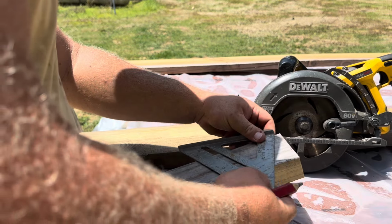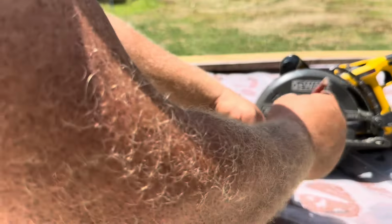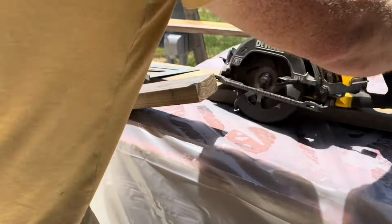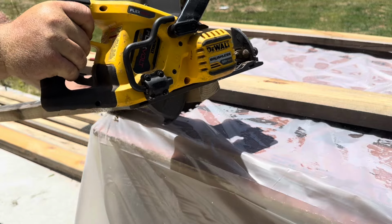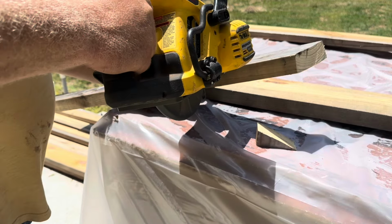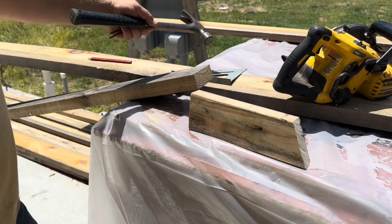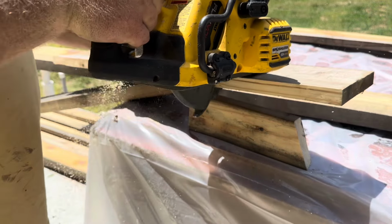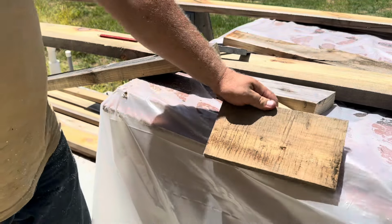We're going to take, set our pivot point up here, come down here on our common cut, and we'll come to a 5. And then it'll be a 5/12. We're just gonna come here with the board. I don't know, that long. And we'll find us another board we can nail on top. We'll take this piece of pallet material. Rip it again.